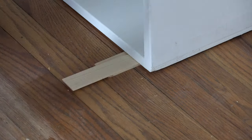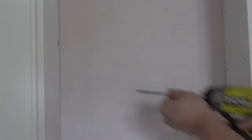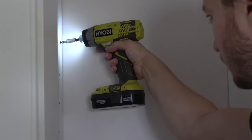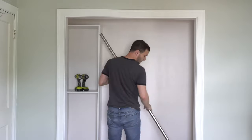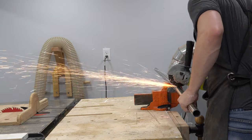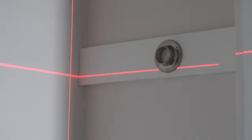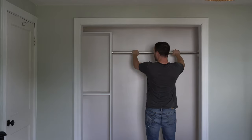When installing the shelving, I had to shim up the bottom a bit to get the shelves to stand plumb, before securing them to the wall with some 3-inch screws into studs. Last up was fitting the clothing rod into the new space. I marked its new length and cut it with an angle grinder. To be honest, it would have been better to do this with a hacksaw, but it wouldn't be nearly as fun, nor as dangerous. I installed the clothing rod with a laser level, because I'm OCD about that kind of thing, and I found some old leftover shelf pins for the removable shelves.